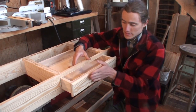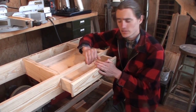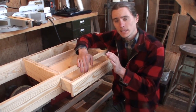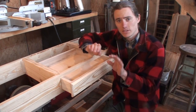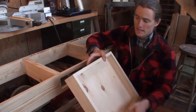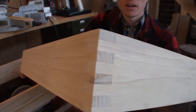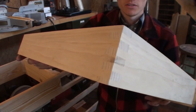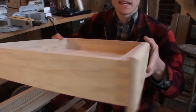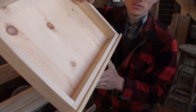If it were a flush-mount drawer I would take even more precaution, but it's straight enough. You can also bevel the corners slightly with a hand plane — that really straightens out the appearance even if the cut is slightly wavy. The drawer itself is constructed out of a poplar frame with a pine bottom, and the corners are box joints — also called finger joints — done on a table saw with the miter gauge.